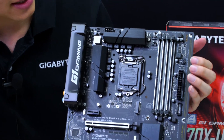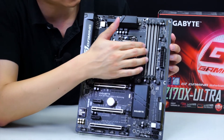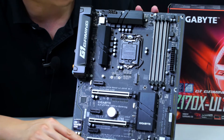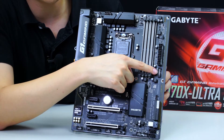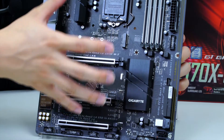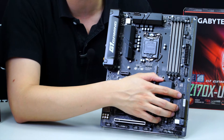On the side of the board there's a green/yellow LED strip for ambient surround LED illumination. Gigabyte has also implemented diffusers on the DDR slots to let the light show even more, with lighting on the top right, bottom left, and on the PCIe slots. Moving around, there's another system fan header, the ATX 24-pin, a USB 3.0 front panel header, and a set of Thunderbolt pin headers — allowing you to add Thunderbolt ports via an add-in card or front panel bay drive, with the board recognizing the attached Thunderbolt device.